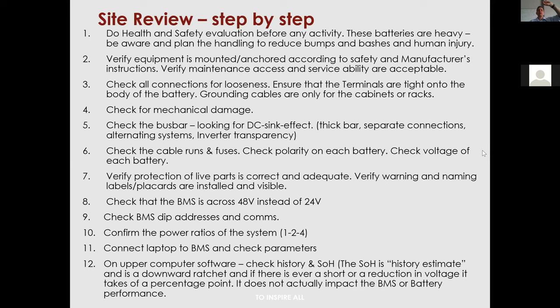I've seen a couple of people put the little brown cable — the positive cable — onto the same first battery from which the BMS negative was also coming. This effectively powered the BMS across 24 volts instead of 48 volts. In one case it was fine; in another it blew the BMS — I suspect they also pulled out the plug while it was charging.